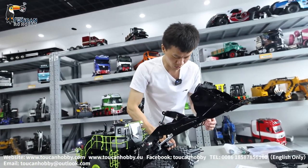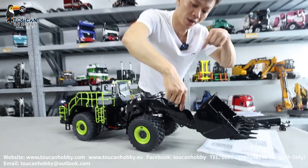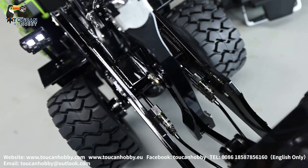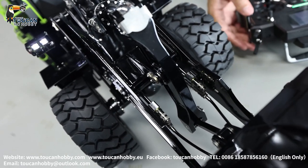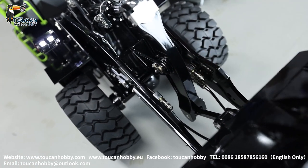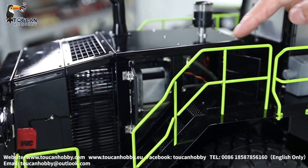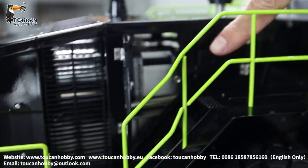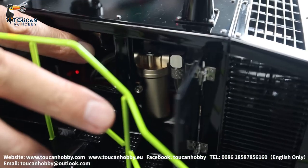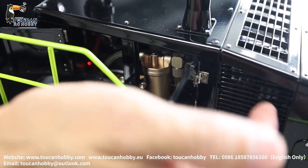On the underside we have two more — come to see here — we have two pairs of holes, that's for spare huge upgrades. There's an operation port but no controller because it's not connected to upgrade parts or the spare oil channel. Each side door can be opened — here you'll see inside: that's the pump and valve, valve and pump on the other side. From this side you'll see the pressure gauge and also the filter, and the cooler is inside at this point.